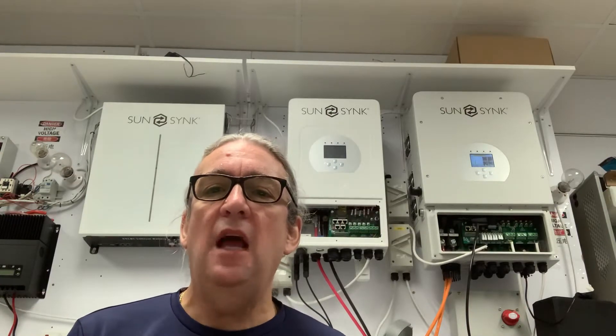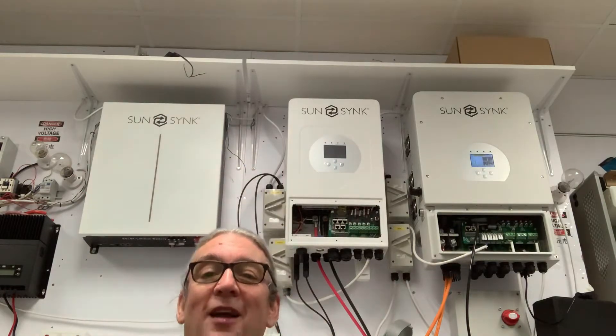AGM and valve-regulated batteries are the older type — much cheaper than lithium and very tough and robust. But nowadays everybody wants lithium, so please make sure you are communicating. If your battery is not talking to your inverter and you haven't got the correct data, seek advice — there's no point going any further. Early on, connect your battery, check it, then switch off and isolate it. Don't leave your battery connected and switched on while carrying on with the rest of the installation — you could electrocute yourself.